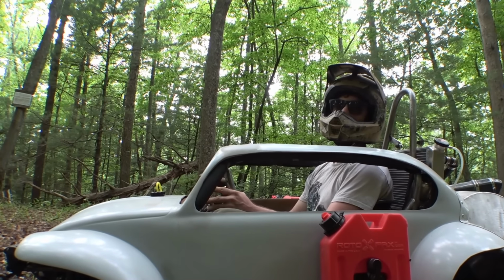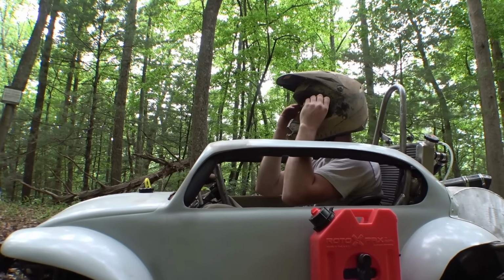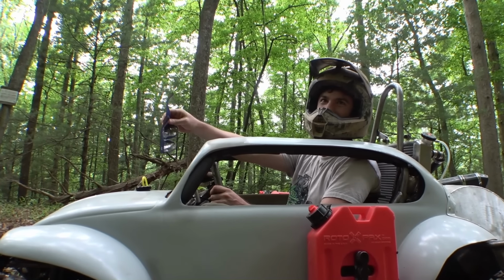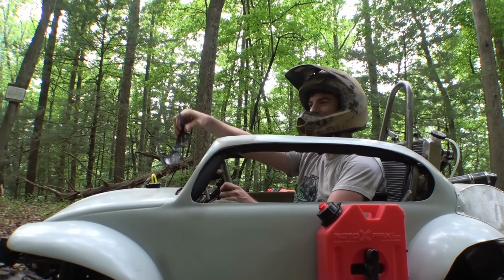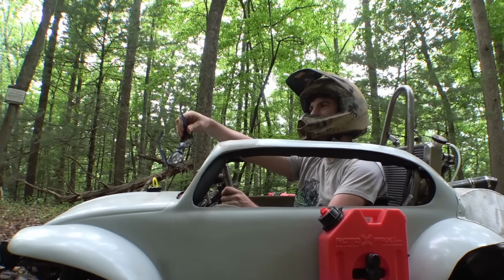I think we are cooking this engine. Afraid so, pal. With that run, it was a 178. So I think I need to do something with the radiator. I think you've got a foul plug now. Really? Yeah, because of the lean.